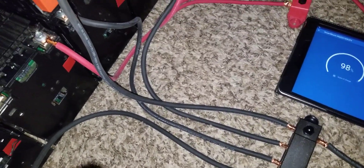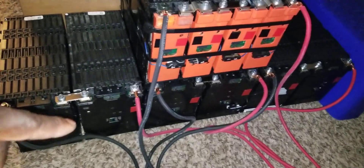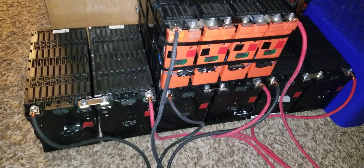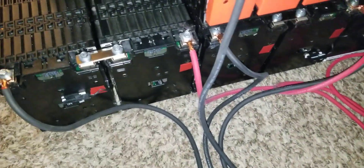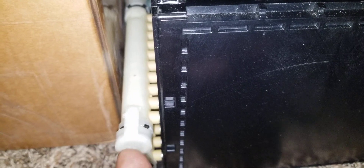I'm using Royal Excellent 6-gauge cable here — I have four of them. If you calculate those four wires together as one conductor, that's effectively a large cable. They all run to the bus bars so the power is equal across all legs. I put clamp meters on them and they read the same, which is correct for a parallel setup — all the same length. I put crimps on but skipped the heat shrink; it's just a quick test setup. These batteries also have temperature sensors and connections, and they're the first batteries I've had with a liquid cooling system — uses antifreeze coolant, with a fan on the back.